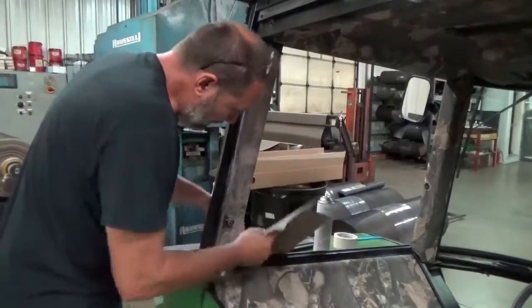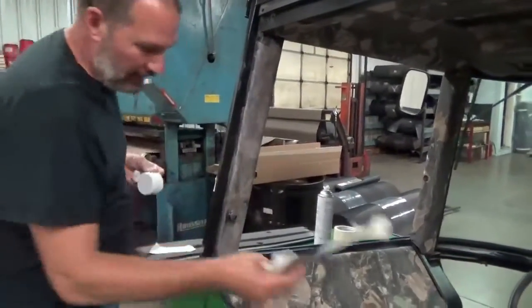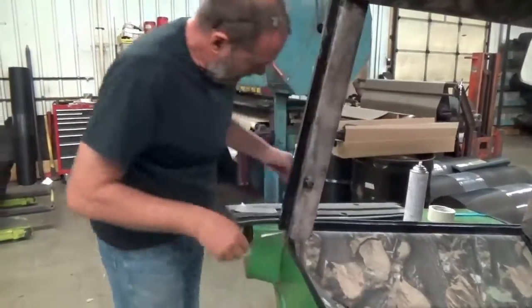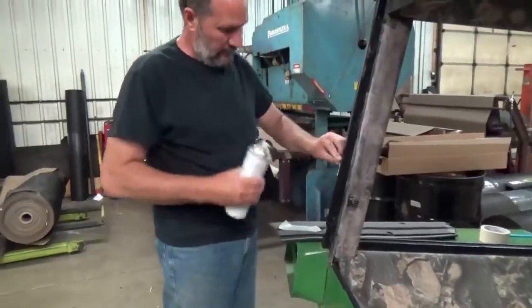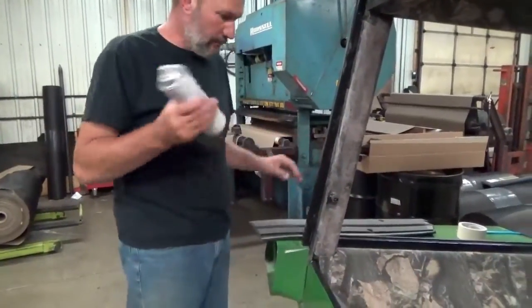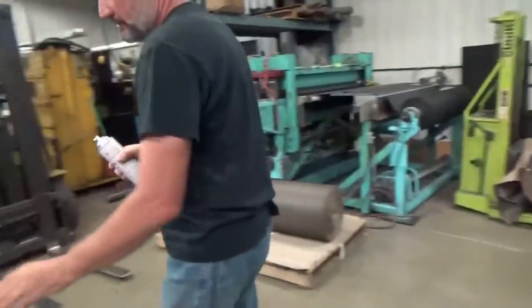And when you put your adhesive on your foam, you want it actually a little wet, because it won't peel off of that foam because it's so porous. But if you keep it wet, then if your alignment isn't absolutely perfect, you can peel it back and reposition. It gives you a little bit of an opportunity for repositioning.